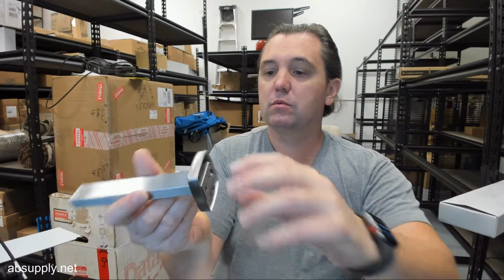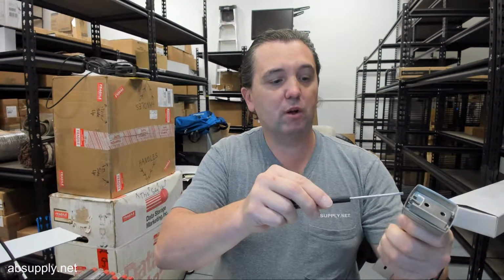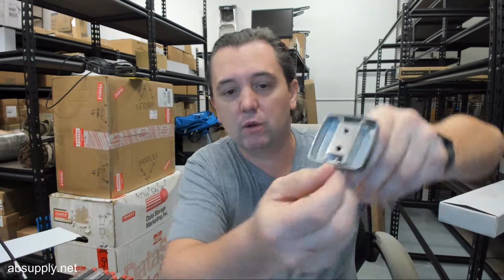We're going to go through the specifications one at a time. A 2x2 mounting flange, and that's incredibly common, this 2x2 footprint. This is going to feature a set screw here that can be removed to allow you to get to that wall mounting plate, and I'll demonstrate that now. Get our hands on a small screwdriver, we'll be able to drive that screw down. Don't remove it, no reason to take it all the way out, because that plate will come out without completely removing it.